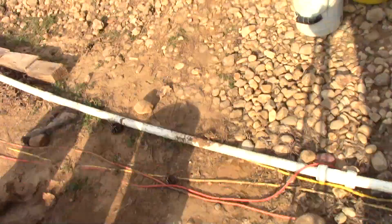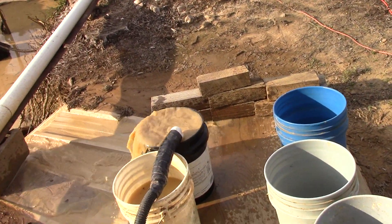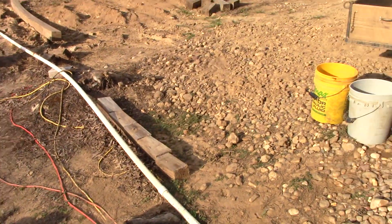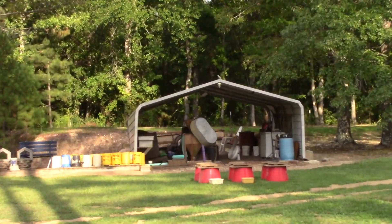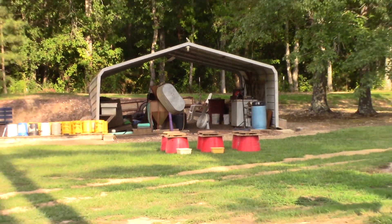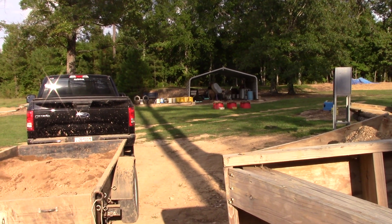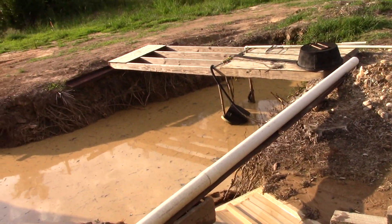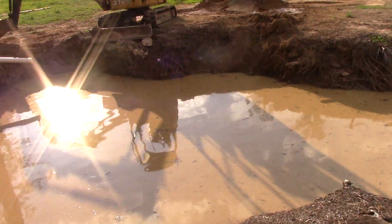I will take all the buckets — this is material I gathered throughout the day — I'll take these buckets of heavy minerals, the small, real small stuff that fell through the screen, and I'll take it over to our plates jig in our mining carport and I'll jig it out. I'll jig the sixteenth-inch together, I'll jig the eighth to quarter-inch size together, and I'll jig the really fine material together, and then we find the diamonds in it. That's how it works.